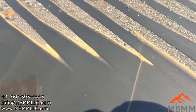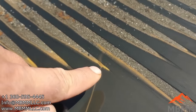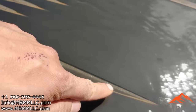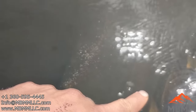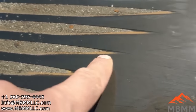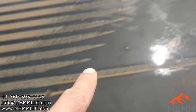Here's the top three grooves, and the gold just piles up in those three grooves. And when it comes across, it gets into this long groove up the cleaning plane and up under the water bar. Some of the gold gets past. There's a little bit here, a little bit there. But then once it gets down here, you don't see hardly any gold in any of the grooves.